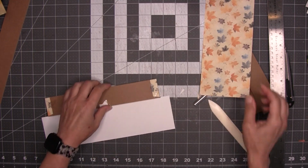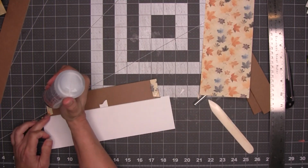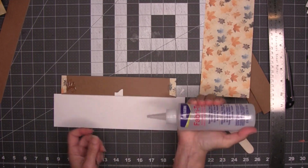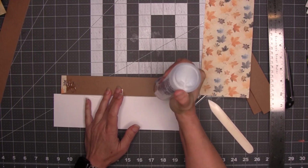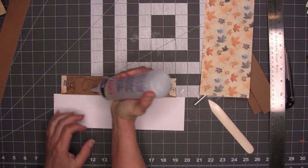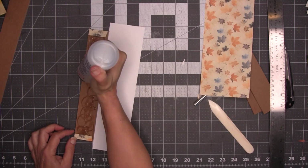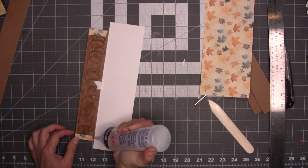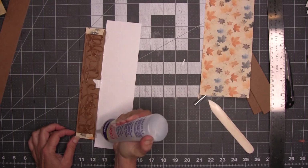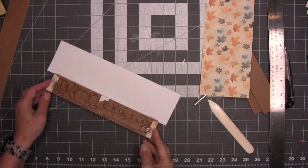So once that's done, now it's simply a matter of getting glue all over this facing side, and basically it's glue it up and make sure you run a good bead of glue along the exposed edge or the unexposed edge, because you want that bound really well, and then across the area I'm doing now so that the top of the side is nice and tight and well stuck.